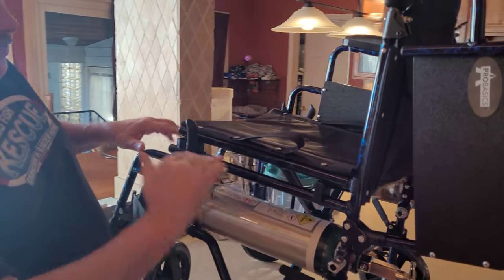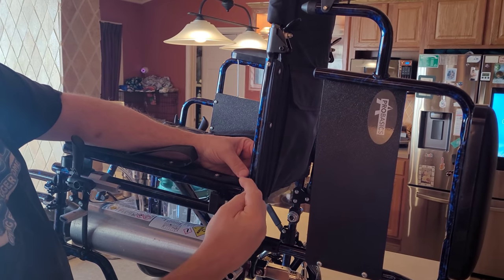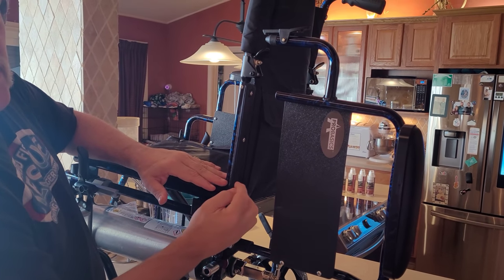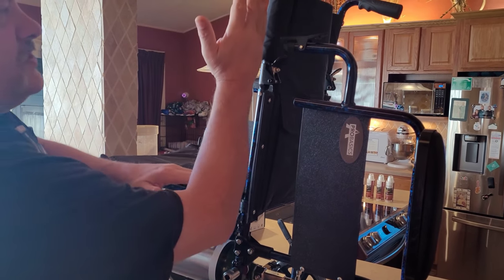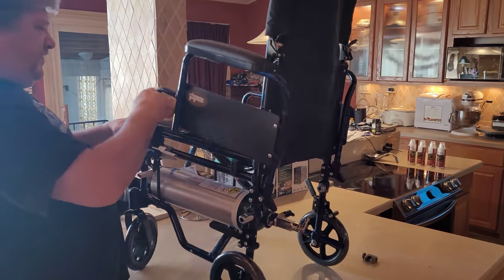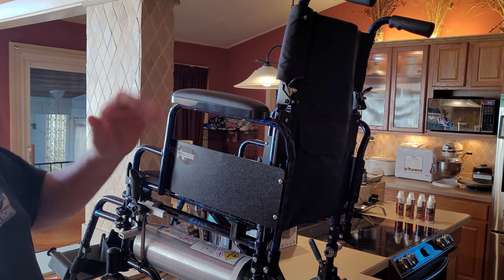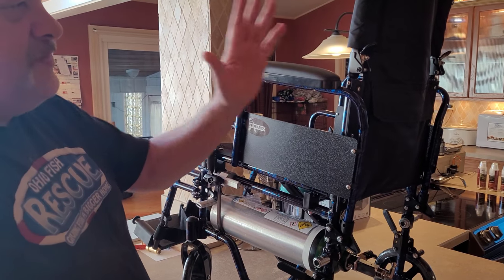The seat is already at an inclined back, so we're okay there. If I take this off the back, I can take this metal pole right here, use a cutoff wheel to make a slice into the back and then a slight wedge slice, bend it back until they touch — that'll give the bar a lean back. Put a little weld across the back, retouch the paint, screw the seat cover back on, and it will tilt the whole thing back. That's the way I'm going to do it. There's plenty of room for this bar to come back at least an inch, giving her the proper angle to sit up on her own without us having to tie her in. I can then put the big wheels back on and she can still be leaned back a little bit.